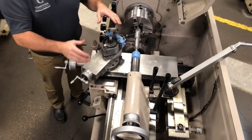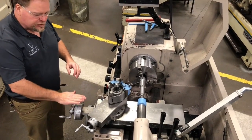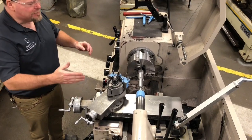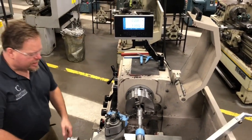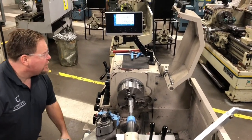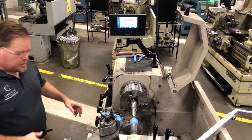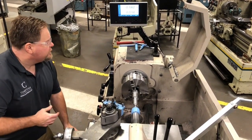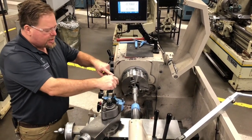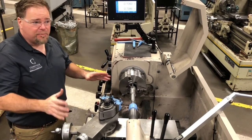This is a telescopic taper attachment, so you cannot turn this handle at all. If you turn this handle, bad things happen — what happens is it starts going straight. I'm going to do a demo. See how both axes are moving? If I accidentally move this handle, when I move this you can see the backlash in it, so it'll go straight. What you'll get is a cut that's taper, straight, taper, straight — and that's the opposite of what we want.